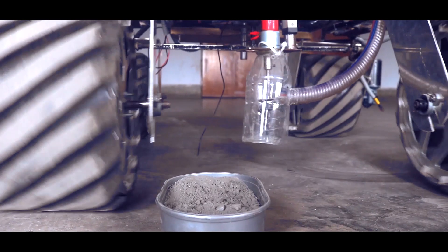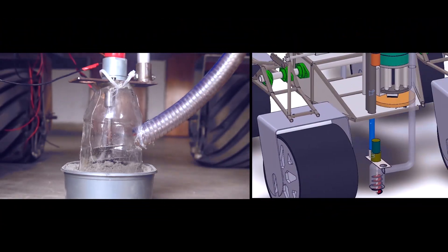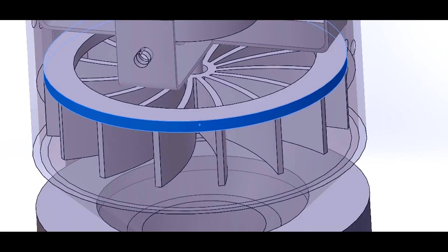This year, for the science mission, we have remodeled our science module for onboard testing of biomolecules to detect the presence or absence of life. We have designed a soil collection system to collect soil using an auger and transport it to the fully automated reaction chamber using a vacuum mechanism.